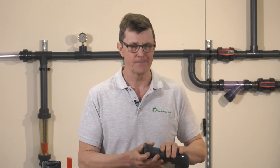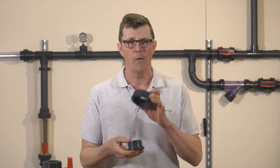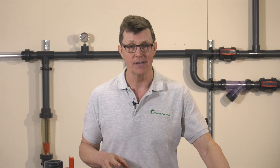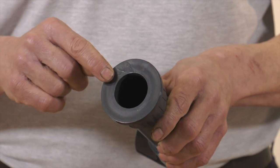To try to overcome that, when you take the valve end off, always make sure you keep the union nut over the top of it at all times. Another problem with doing it this way is you can end up with cement running down the face of the valve end, which is the part that's supposed to seal on the valve's o-ring. The cement attaches to the plastic very quickly and if it's not wiped off immediately it can damage the face and affect the seal.